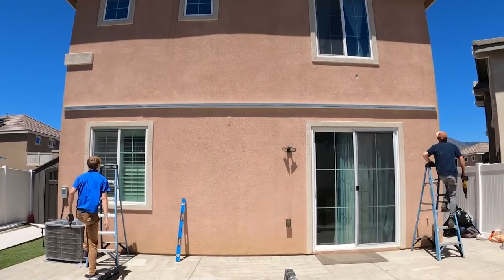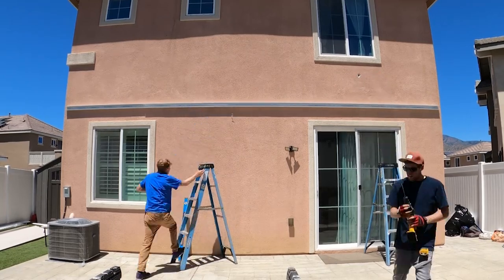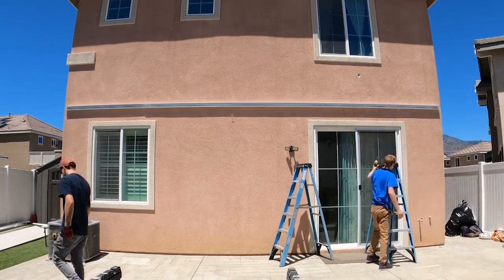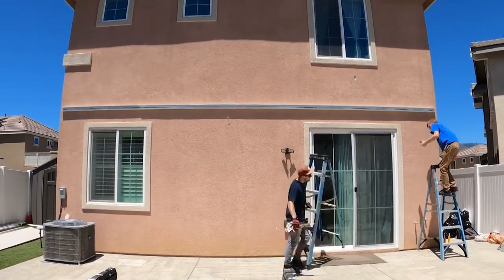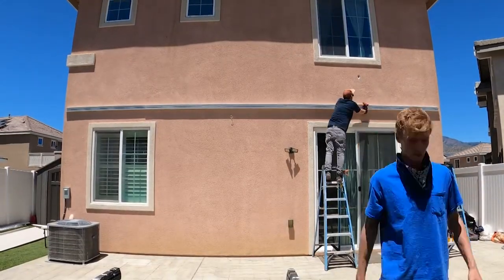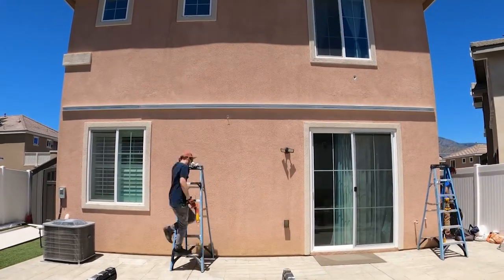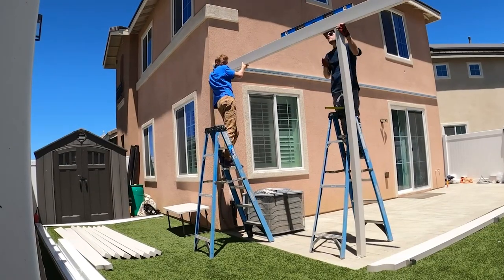You go through the wall a little bit with your hammer drill, and then once you hit wood you put in the lag. There I'm pulling for electrical. And that's the first layer of caulking that we put against the house.